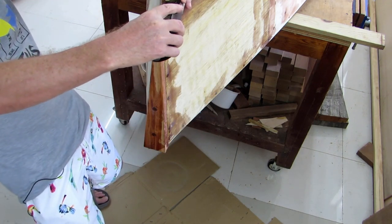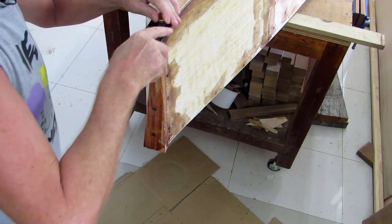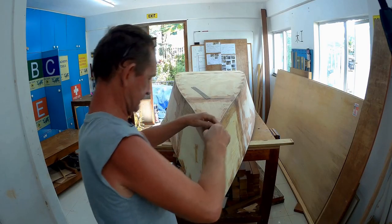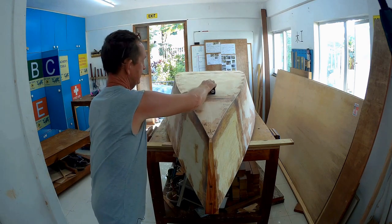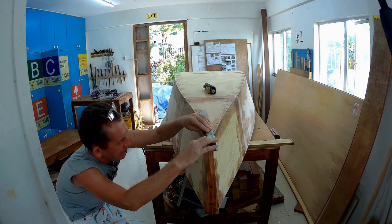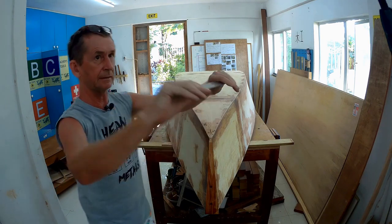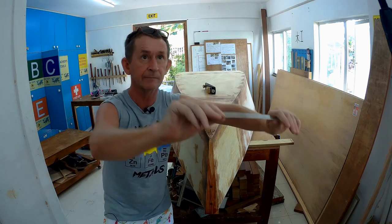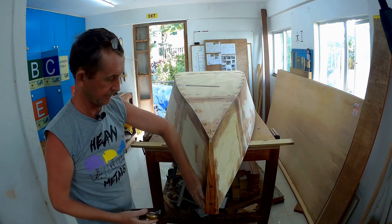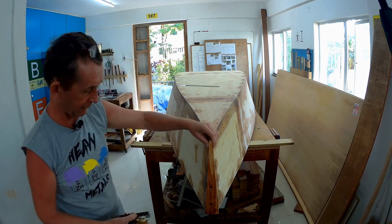You can use the plane. You see it's going like that — that's too much. And we use a ruler. To make a fair curve, the ruler will go like this, and that is perfect. In other words, there's no hump. The ruler is bending and that's going in with that. I'm going to chamfer, so to speak, down these.